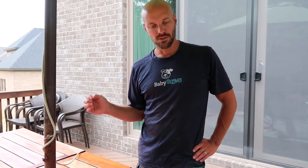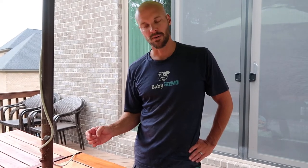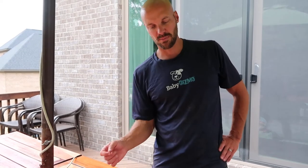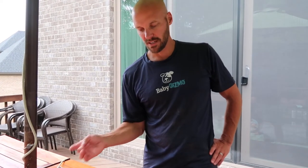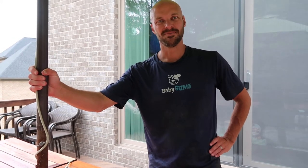That really wraps it up for this one. We just have to wait for it to dry — they say it's got about a six to eight hour dry time. So far it looks really good. The only thing I would change is I used those 97-cent sponge brushes to put on the teak oil and I broke two of them because they're really flimsy. So either buy a bunch of them or just use a regular cheap brush. At the end of the video I'm using my fingers, which gets a lot of oil on you and means more cleanup. Subscribe to our channel, give us a thumbs up, and tell us about any teak oil or refinishing projects you've done — chairs, tables, decks. We'll compare notes. See you next time!